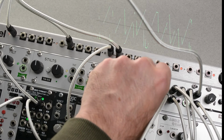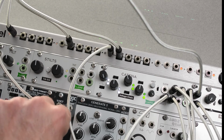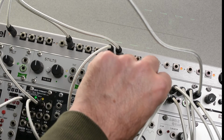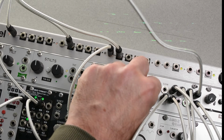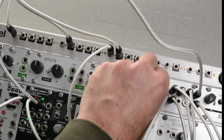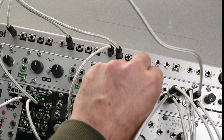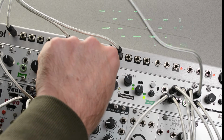Now, this is an adder, not a multiplier, so faster signals will give amplitude modulation and not ring modulation. However, many rich timbre effects as well as subtle, slow-moving modulation can be added to the existing input and offset setup. Even some pseudo VCA and gate effects are possible with some module pairings, or at a push it can be used as a 5-channel mixer.